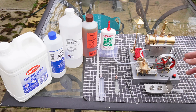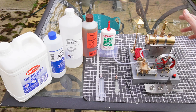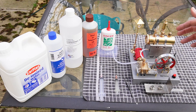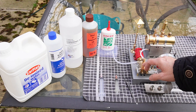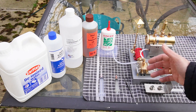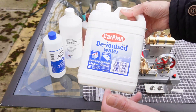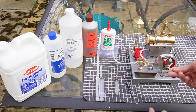On this video we are going to fire it up for the first time, but there are a few things to go through before we get into that. Firstly, the water that you put into the boiler — please do not put tap water in your boiler, because when it boils it will create limescale. All of this valve system and the engine itself will just clog up instantly with limescale. So you need to use deionized water, which is very cheap to buy online.